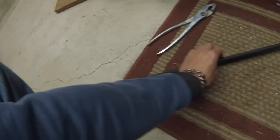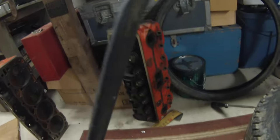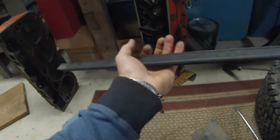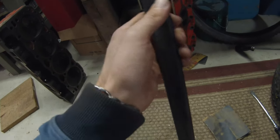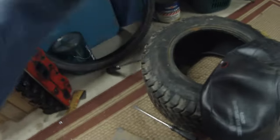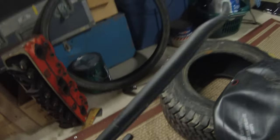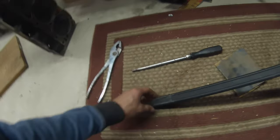So here's the tire. I bought this about a year ago - it's a 24 inch flat pry bar, a tire lever basically. And it works really good. You do scratch the rim a little bit just around the edge, but if you care you can put tape on it. But this will actually do car tires - I've actually done four car tires with this, changed them manually. It wasn't too fun but it worked. You just put it in and then pry it, and I still used a screwdriver just to hold the place so that the tire doesn't slip back in on the rim. But it makes it way easier than using 12 inch screwdrivers because you have double the leverage and it's actually meant for this.